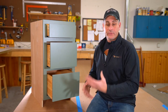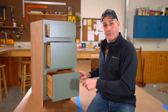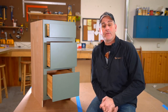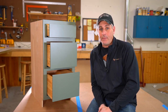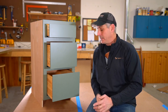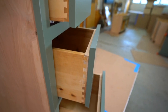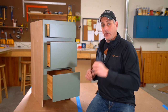In the old method we used — trying to make it homeowner friendly — we used double-back 3M tape where you'd put some tape on the front of the drawer box, stick the drawer front on once you got it lined up, shut the drawer, then run your screws in the back. Not a bad way to do it, but we want to show you the way we do it in the shop. It gives you a faster result and you don't get that crumb catcher gap between the drawer box and the drawer front, because that 3M sticky tape was maybe a 16th or 32nd wide.